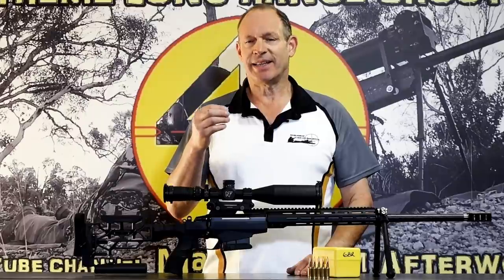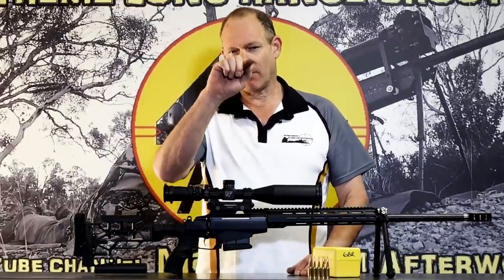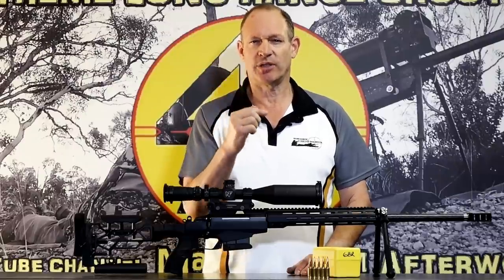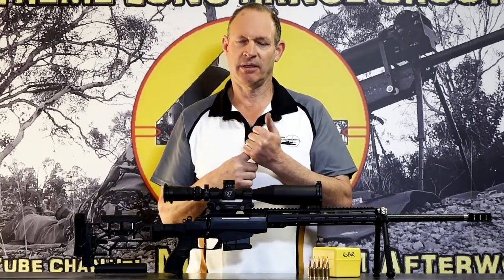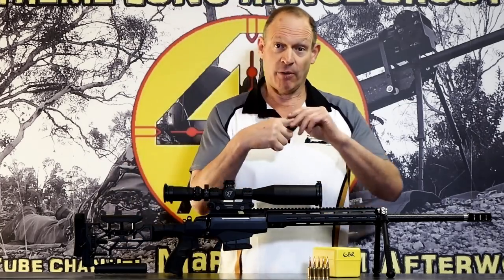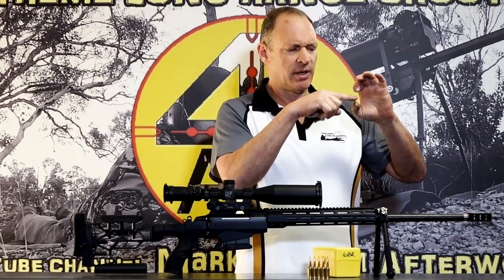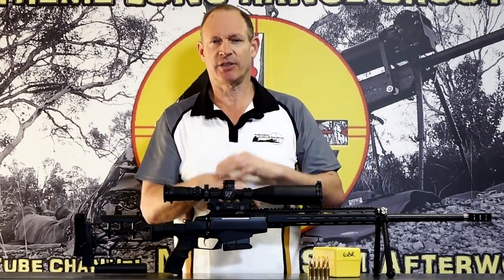the only reason that it would tear or go through is either the firing pin has sharp edges, sharp corners on it, which it shouldn't have, which would cause it to tear rather than bend the metal. Or it's going in too far, where there's too much expansion, too much stretching of the metal, till it ends up tearing because it's too far.